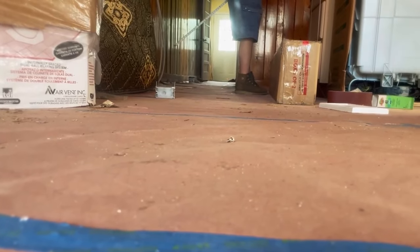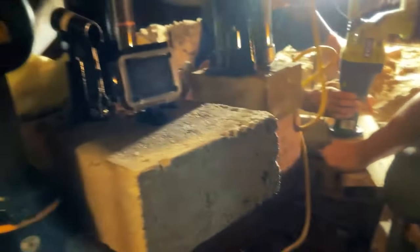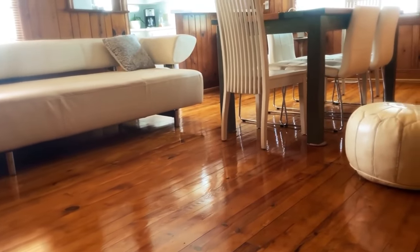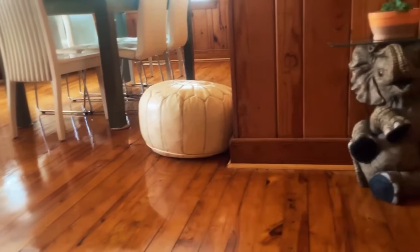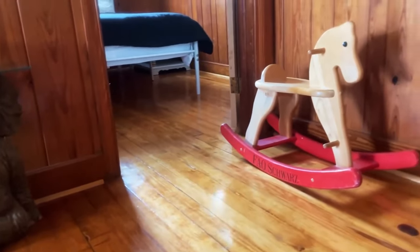You will not make your floors perfect — don't dream about it or rely on it too much. Your main goal should be not just leveling floors, but putting piers to support the existing sagging structure, and by doing that you work your way toward leveling floors where they are too far down. My contractor did a great job, but the floors were nowhere near perfect. However, once you add furniture and a little carpet or rug, you're not going to see the imperfections at all — everything will look like a nice solid unit with strongly set floors.